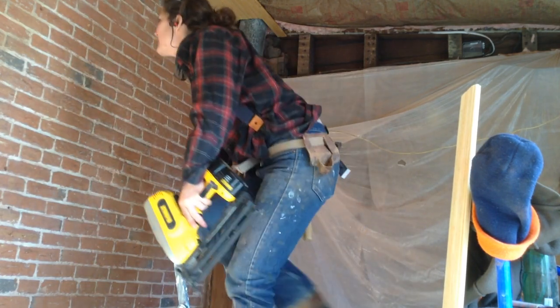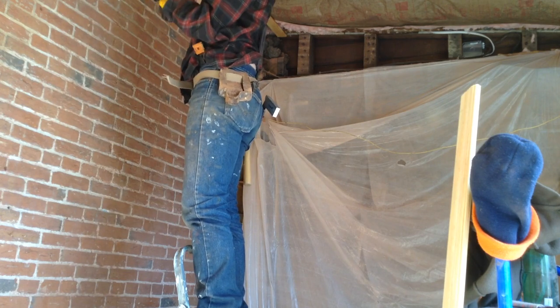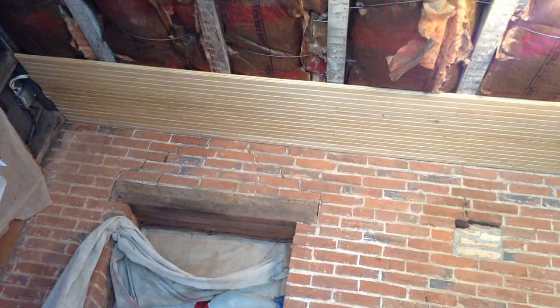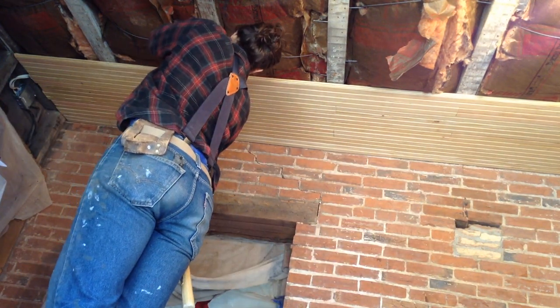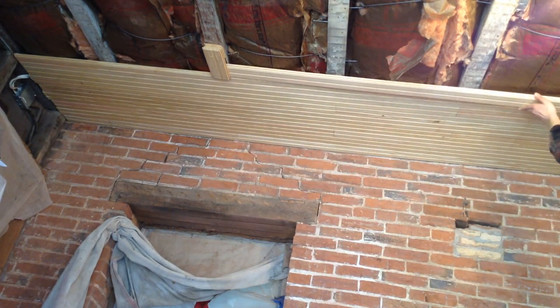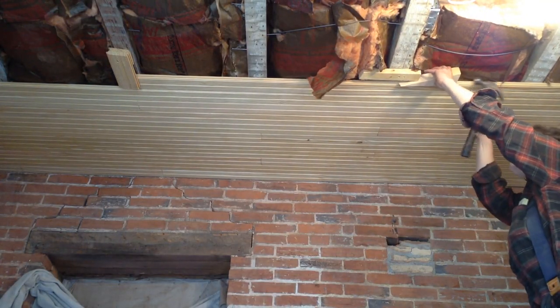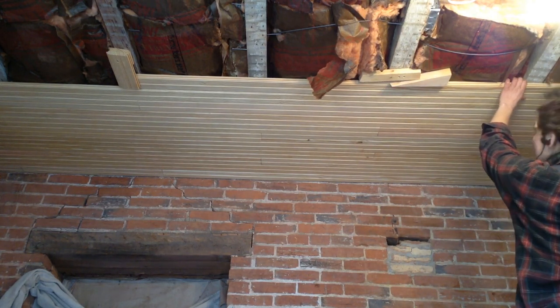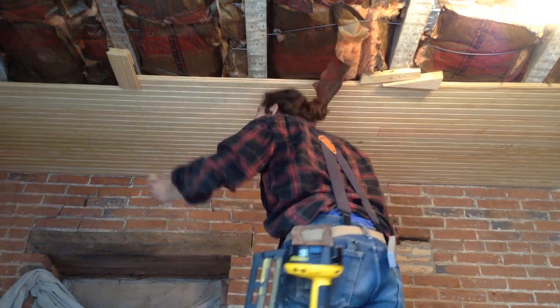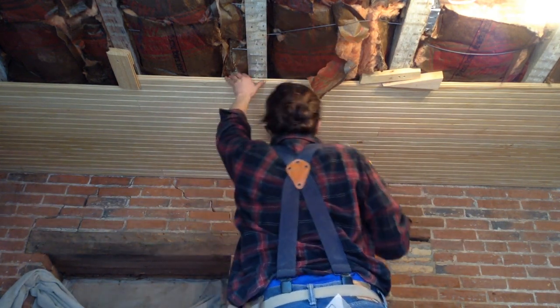Someone gave me this cordless nailer a couple years ago — he said he'd never use it so I could keep it. It was super handy for this job, though you could do it with an air compressor. Here are my two jigs: one is just two scraps that act like a little foot to hold up one end of a piece. The room is a little over 13 feet long so I was using mostly 12-foot boards, which are a pain to hold since the joists aren't totally even. I spent a lot of time at Lowe's getting straight boards. For bowed boards, I have a triangle scrap and another piece of wood — you screw that to the joist and hammer it in place and it pulls everything flat. I didn't need the triangle jig on every board, just a couple.